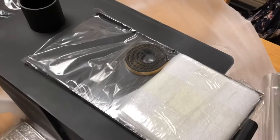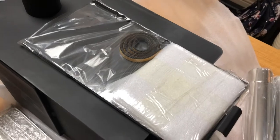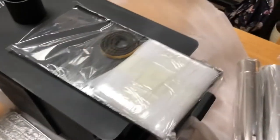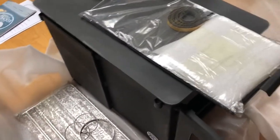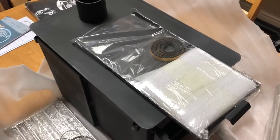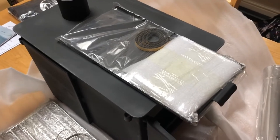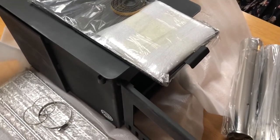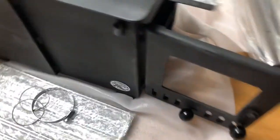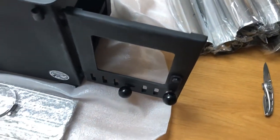These stoves, with them being outdoor stoves, typically don't tend to be that well sealed, but you need to seal them where they're supposed to be sealed, otherwise the thing will just be pulling air in left, right and centre, and it'll just be largely uncontrollable burn. What you want to be able to do is shut the thing down in the way you want to shut it down. So ideally you want air going at the top when it's burning, because wood burns over the top and not from underneath. A lot of people get mixed up with this and they're like, "Oh yeah, do this and do that," and it don't work, you know.